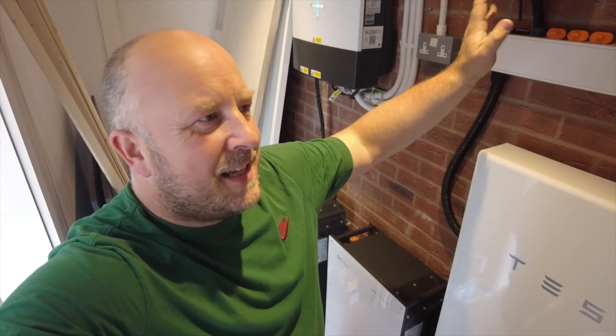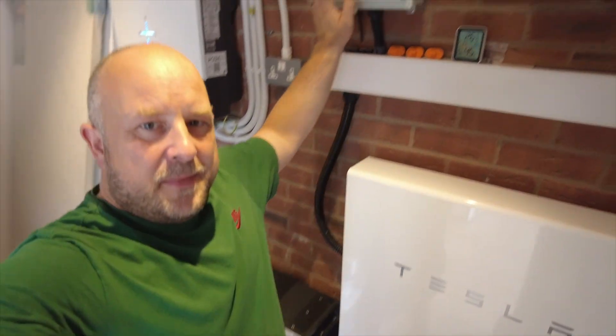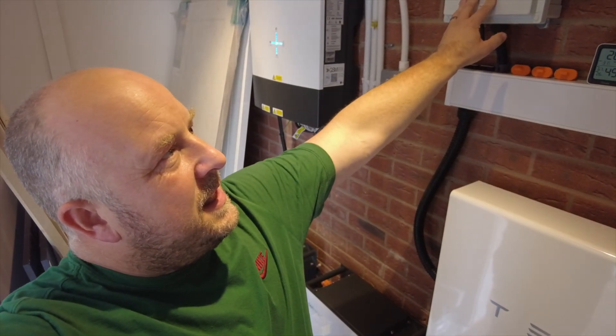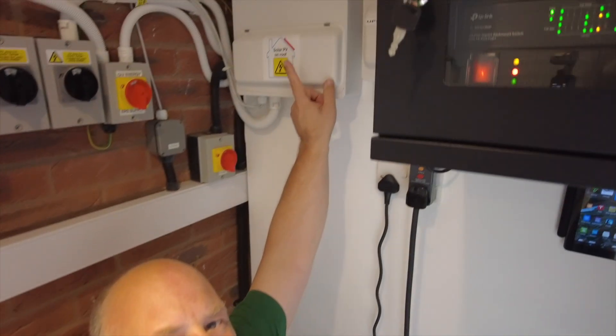This here is my little plant room. I'll explain how things are connected up so it makes sense as we go through. Ignoring the GivEnergy stuff for a minute — just focusing on the Tesla Powerwall 2 — up here is the old original gateway, which talks to the Powerwall. Connected to that is the isolator switch for the Tesla Powerwall 2, and then I have a separate consumer unit in this plant room, which can provide power to the house assuming there is a grid connection. If there's a power cut with that original gateway, there's no grid isolation and no islanding of the house, so it won't provide power.